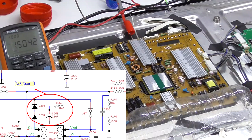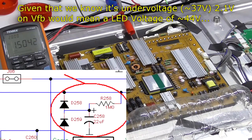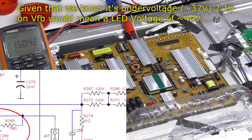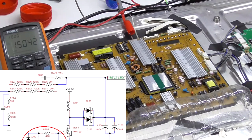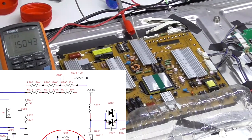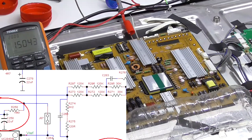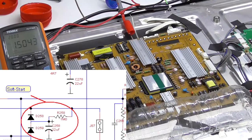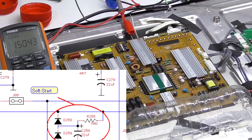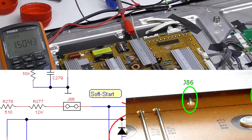So where's the next set of voltage coming in? The voltage could be coming in through the feedback on pin 2, I'd expect, which is on the resistor divider. And the output of that goes to that J86, which is sitting underneath there. We've got mains on this side. I've got my little bottle to help remind me not to put my hand on it. My little torch gun. J86 is under there somewhere. Yeah, that's that one, that little one underneath there.